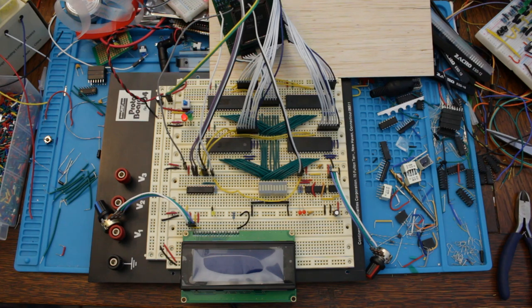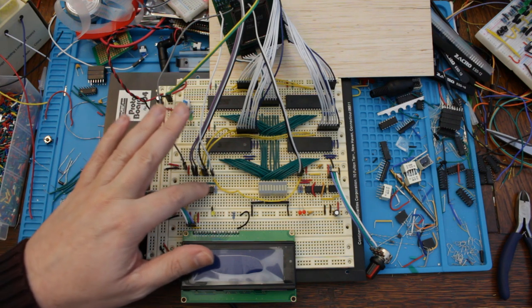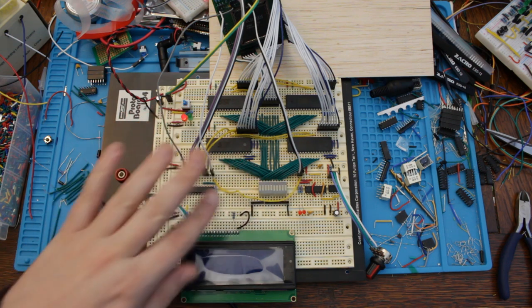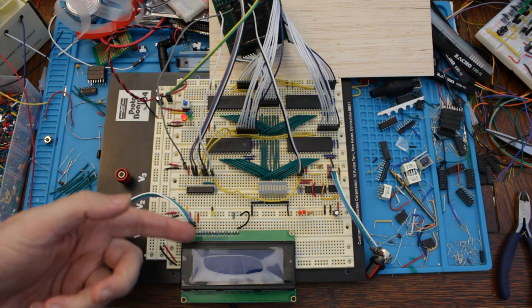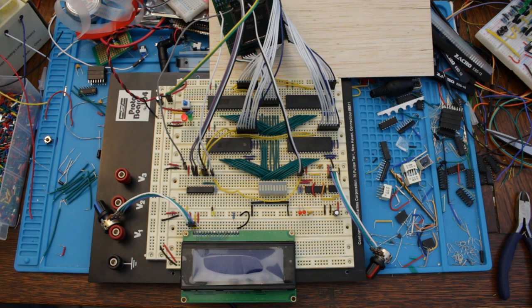Last time in this series I was doing some experimentation with writing to the bus, making sure my understanding of the read versus write signal was correct and that the mechanism I'm using to latch it was keeping it in time correctly with the addresses on the bus. I didn't want to get into a situation where the LCD writes to the bus at the same time as the CPU. That went pretty well - the new program worked fine and I could see on the LEDs that the read versus write signal was happening as expected.